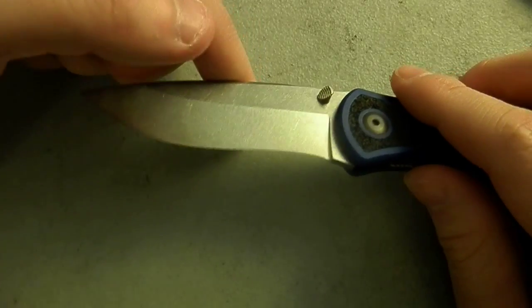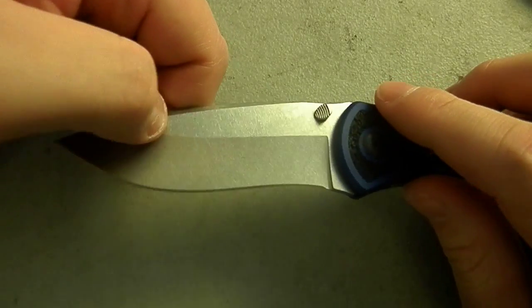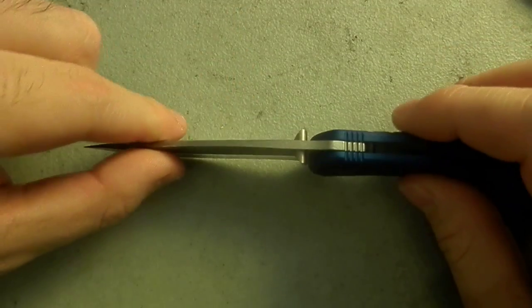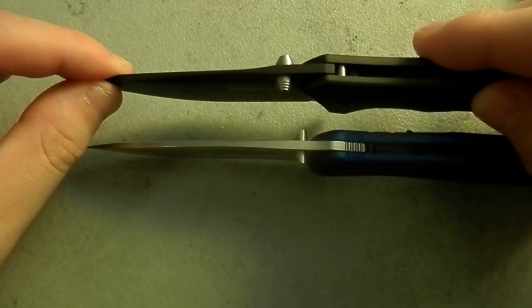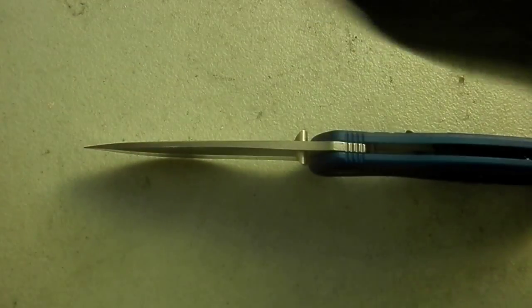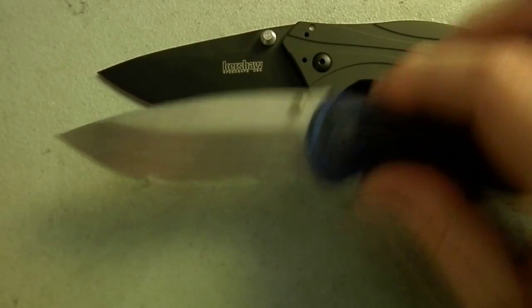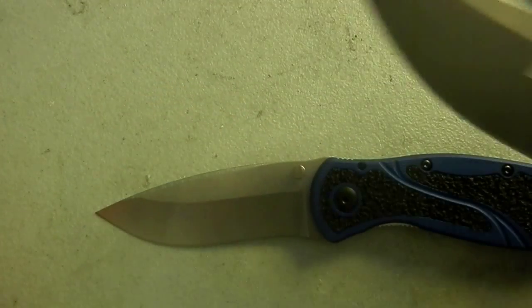The main comparison I want to bring up by looking at these two knives side by side is kind of a geometry problem. Same steel, presumably same plant, same everything — just different grind. The craziest thing is that the stock is actually more or less the same width to begin with. So we get to see what happens when you play with the angles a little bit. This Knockout is much deeper. The Blur is not that much deeper effectively, but the grind is much steeper, and your primary bevel is a little bit steeper.